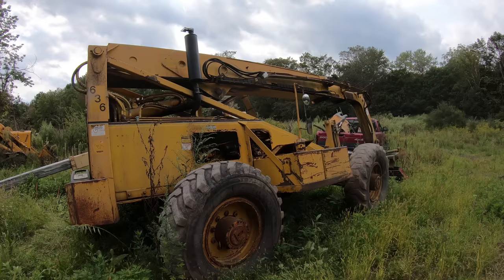I'm going to take a guess that this thing probably weighs about 350 pounds. The only way that I'm going to make this work is if I build a jig for it. I could build a bench, but that would take forever. I could build something on the ground and make a triangular thing that has a V-shape on the bottom and another V-shaped piece on the top, and then you clamp them down with two bolts and they have long legs going out on each side. If I did that for there and there, and then used wood where the V is inside of it so it doesn't completely damage these, then I could probably make a jig so that I could turn these.